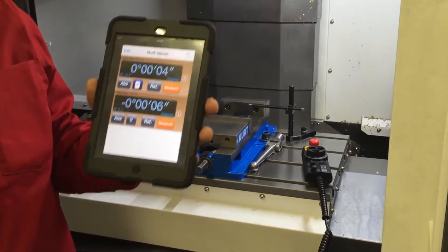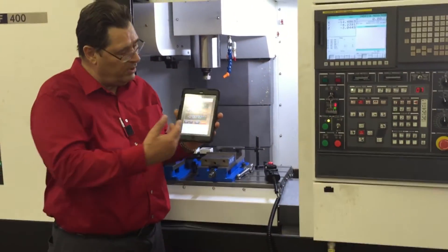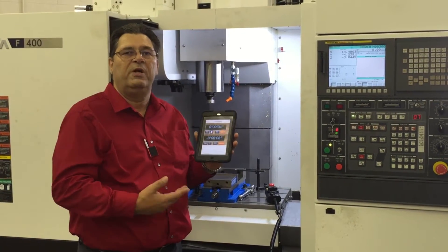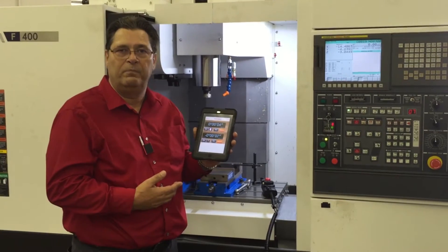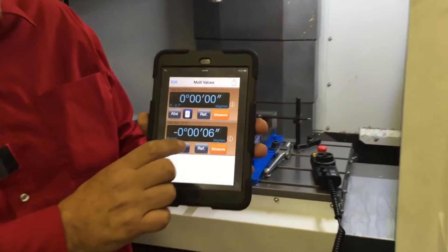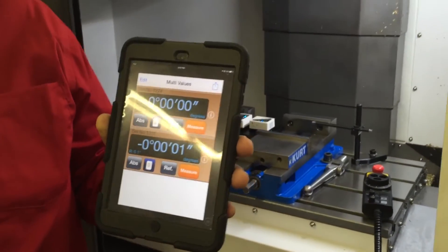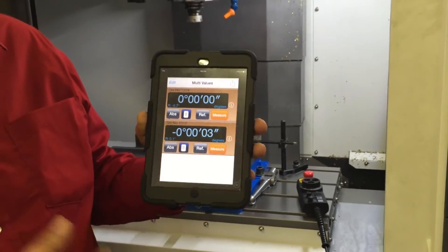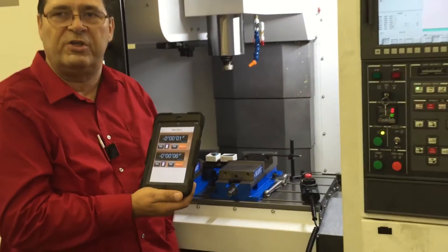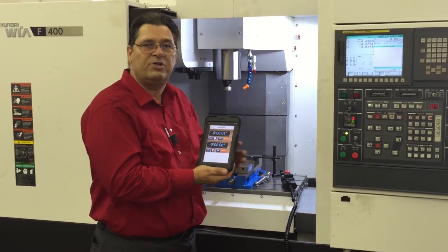Now this tells me that the machine is level to earth level, but I want to take this one step further. The important thing about this machine is that it moves within plane. So at this point I'm going to take both of these levels and set them to zero. I now have a zero set at the center of the machine. I can now move the machine from front to rear and side to side using the same setup and see if the table is pitching as it moves.